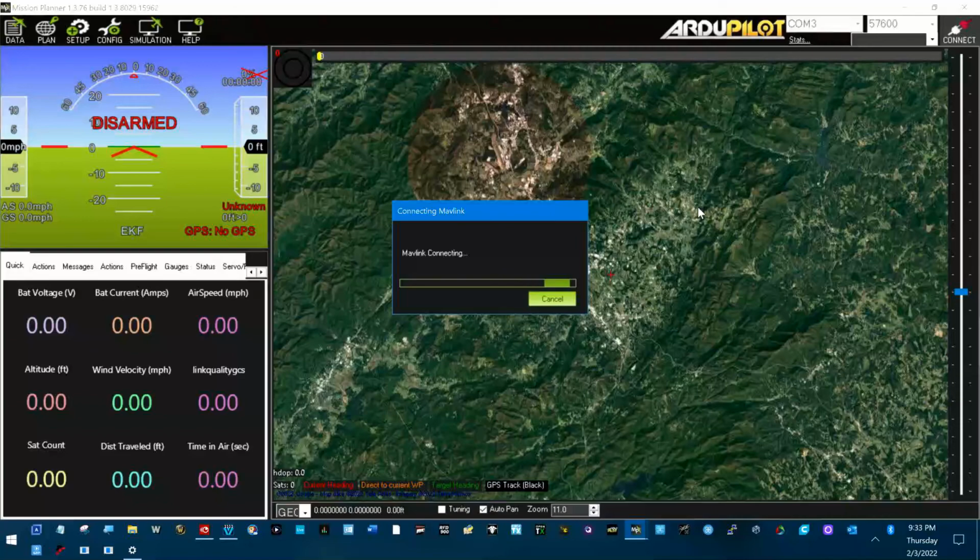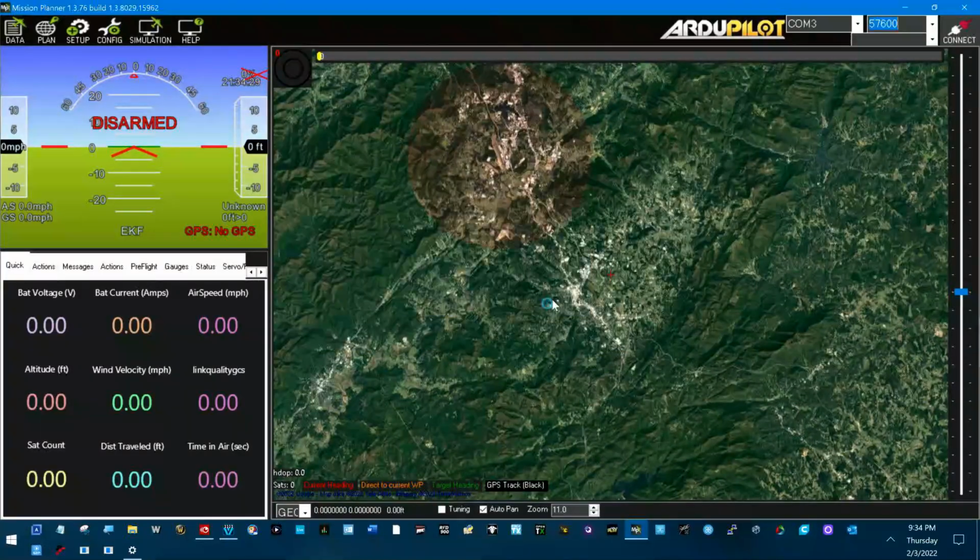This is Bluetooth, supposedly. See, that looks like it's sort of connected, but nothing's happening. And it'll go ahead and count down the rest of the timeout period until it just errors out. But it sort of looks like there's some kind of connection up here. And I'm letting this finish so I can click on link status up here. That's part of Mission Planner, not really a Dragon Link thing. Again, no heartbeats received. Oops, and my link status went away when it disconnected.